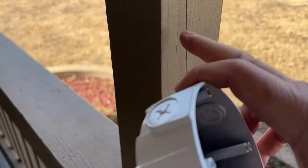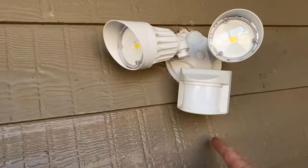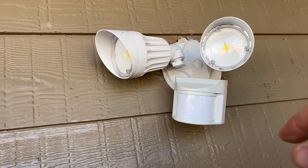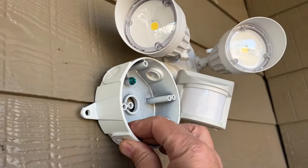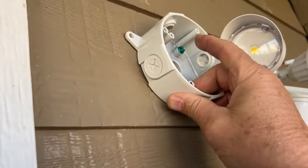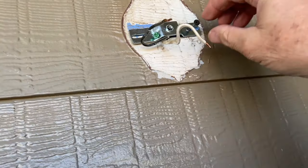I don't have to drill in and recess a box and worry about hitting wires. If I start coming in here, I don't know where there's a stud or where the wire is coming at. If I have to dig a big hole in order to get a box recessed, it would be a pain — and this is in the corner. This little box right here is going to extend this out that far, which is probably better because it's so close to the wall and I'm losing some light right here. So this is going to extend it out, wires will come out, and that's what it'll look like. I had to put this out so I could get a little grabbing on it.